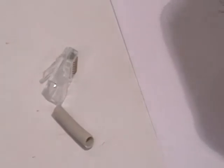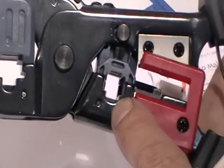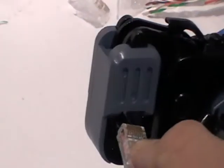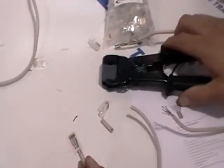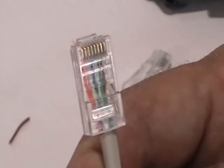I have a connector here where I've pushed the cables all the way in but haven't crimped it yet. We push those cables in at that position. There are two crimping mechanisms on the tool: the smaller one is for RJ11s, but in this case we want the RJ45 slot. We push the connector right into the crimping tool and use the mechanism to crimp it into position, then push the bottom mechanism and pull out the crimp. There is an optional cover you can slide over. We can see the colour code is exactly as set out in the wiring diagram.